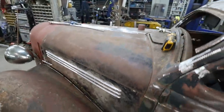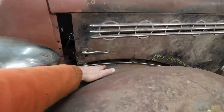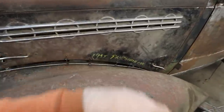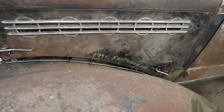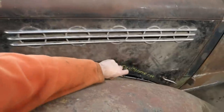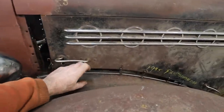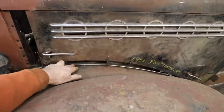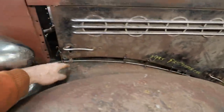From standing up, staring at it, nobody's really going to notice that stuff's a little out, just a hair. I have a hard time getting a very fluid motion to get it nice, so I'm tacking it. So roughly what I'm going to do after is we'll pull it off. I'm going to do a really rough sheet metal sketch of this, and then we'll tack it just above it. And then the bottom will be close, but I think after that I can Sharpie this, and then we can weld this bottom edge to it.